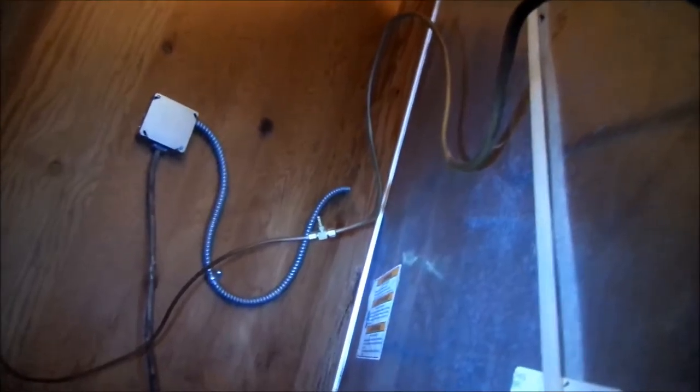So what I did to fix this one was basically take some silicone — I took the nut off, put some silicone around it, and then tightened it up real good. At this point it's been sitting for a couple minutes, the water's on, and it's not leaking at the valve. But I'm going to try and tighten it up anyway. And this one looks good.